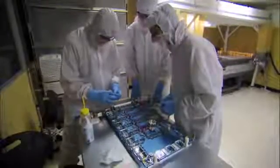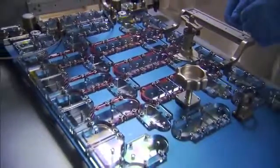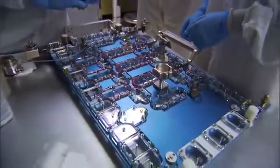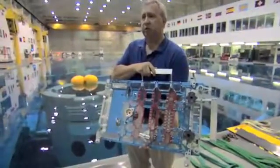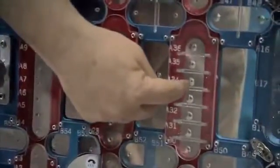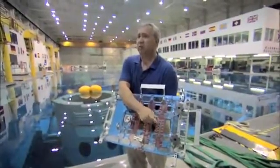The engineers here at Goddard have been very creative in designing a cover plate that we can put on over the top, so that as we take the screws out, they'll be captured by this plexiglass cover. We designed what's called the fastener capture plate. It attaches onto the instrument. It's got holes that the astronauts can access their tool into. They're small enough for the tool bit, but not large enough so the fastener can come out.